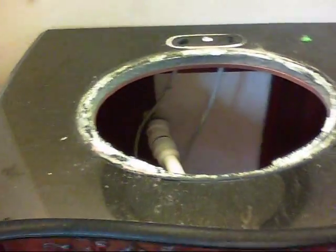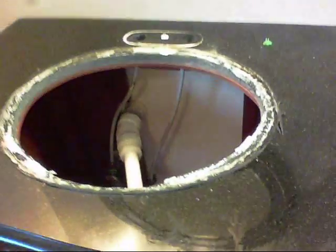Yuck, that's one nasty bowl! We have both sinks out and both faucets out. The next step is to remove the granite top from the base. Looking here, the granite is sitting on top of a piece of wood about a half inch thick. I don't see any other connections underneath, so more likely this is glued to the top — that's what I'm going to try to do next.